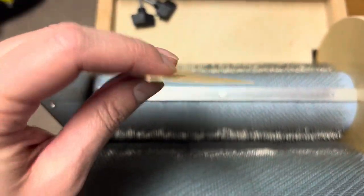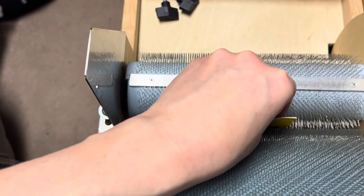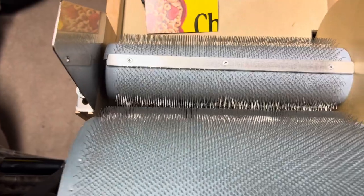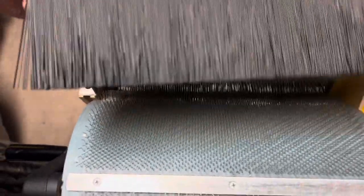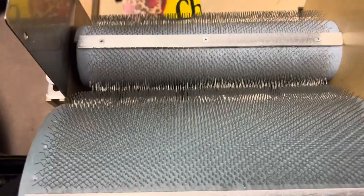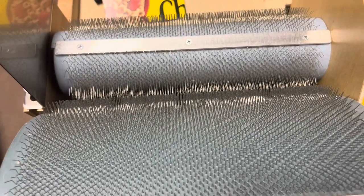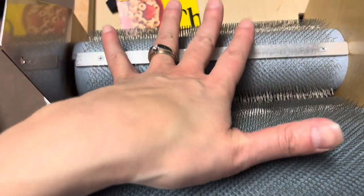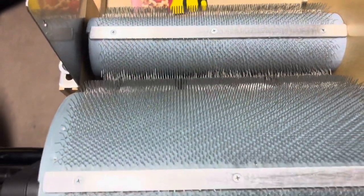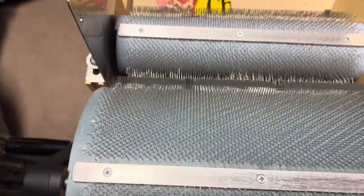About a credit card size can fit between the drums — this is part of a Cheerio box, same difference — and we want to basically easily slide that between without it getting caught. Before I started filming, I did remove the packing brush because I didn't want it in the way. You don't have to remove it to do your adjustments, it just makes it easier so you can actually get to both of your drums.